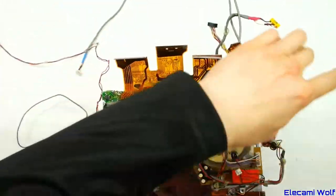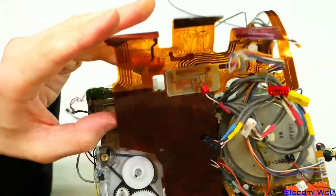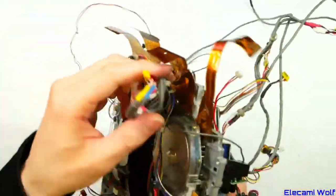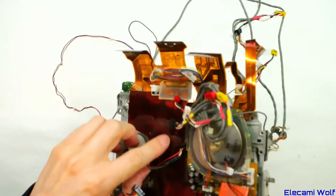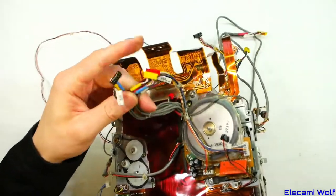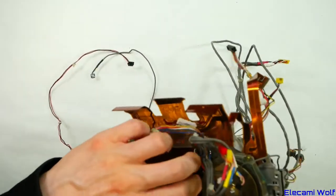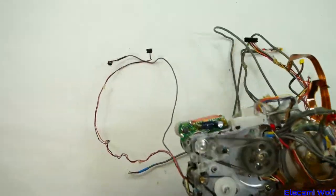The arrangement of this one is fairly complex — there's a flexible PCB which goes all the way through the mechanism and joins onto various things, and then there's all sorts of other boards connected up to this, and a whole bunch of wires going off to things. That's some of the signals coming out of the head drum — probably record and play at the same time. And that might be a flying erase thing, or related to the head motor.